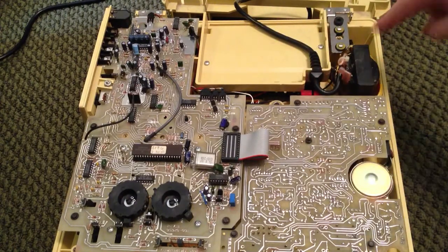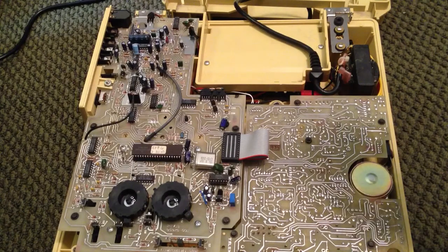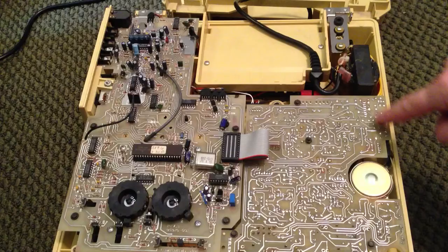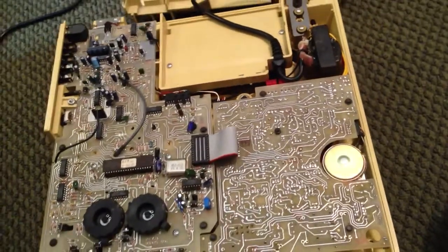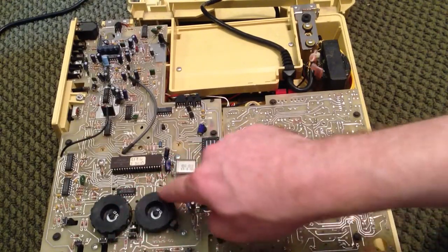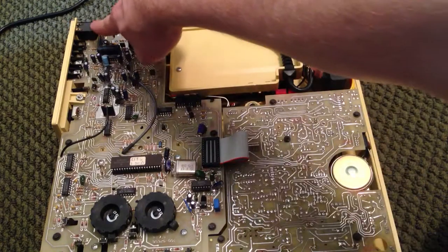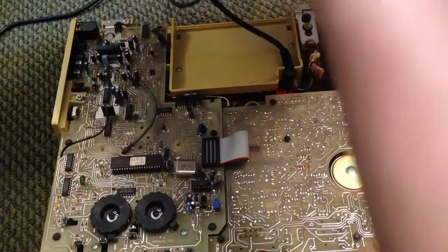Here's the inside of the unit. You've got a power transformer here, and I imagine the rechargeable battery is probably under this plate. To replace or reset the turntable belt, I had to remove this circuit board on this side, which has five screws, and then there's a C-clamp that holds the turntable in place that I had to remove to access the belt. Over here you'll see the inner workings of the cassette deck — the little hubs that are sensor-based and tell the microprocessor whether the tape is turning. And then you have your headphone jacks and input/output jacks, and probably the amplifier on that side.